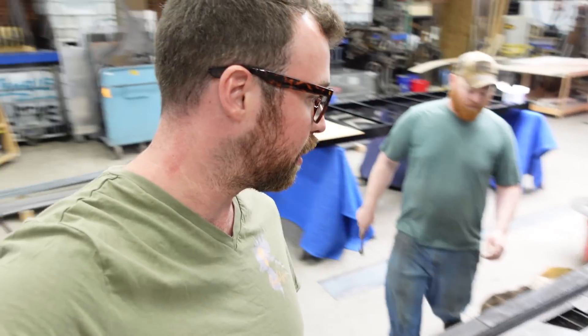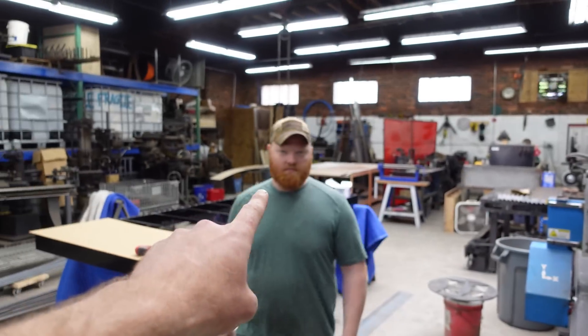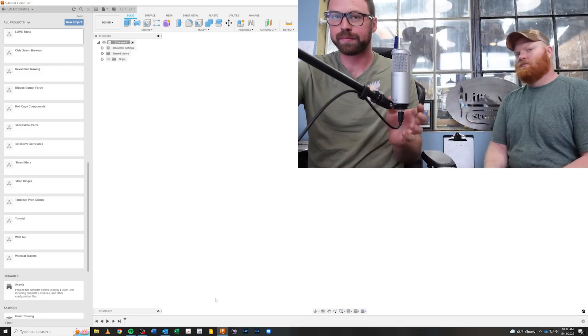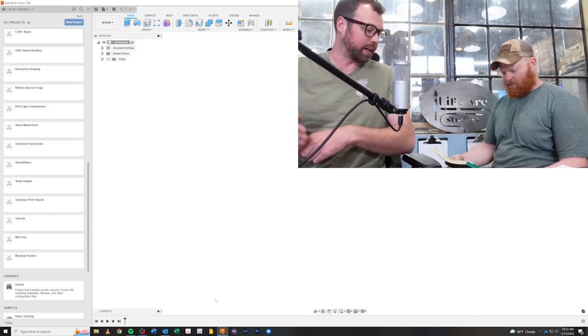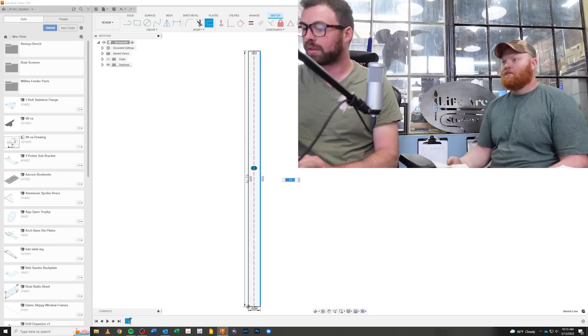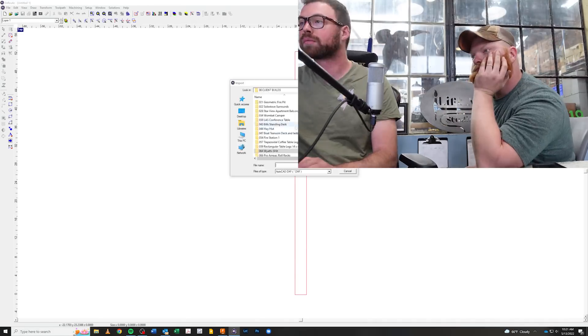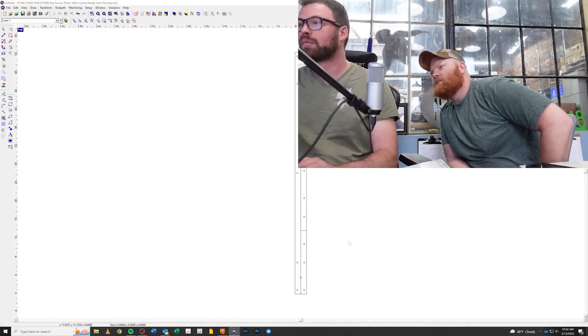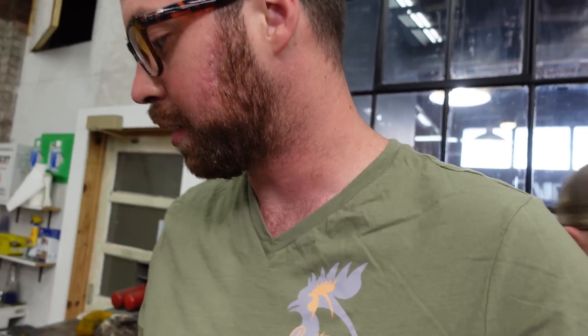It's going to go hopefully quite quickly. We could make a bunch of these jigs, but let's prove the concept first — just another reason this thing is a time saver. Here we are in Fusion, here we are in real life. While you may not have this plasma cutter, this software, or this computer, the methodology is the same. The point is to utilize the plasma cutter to save you from drilling millions of holes.